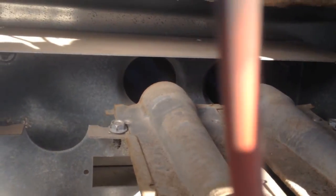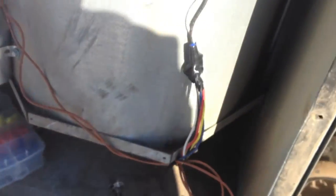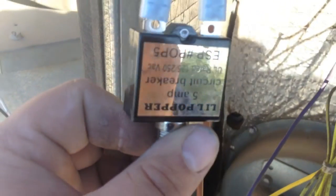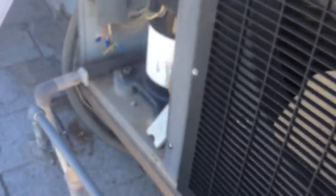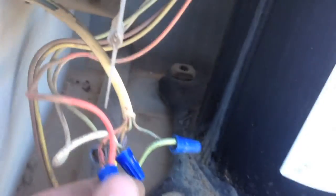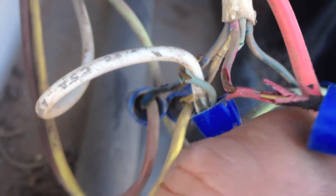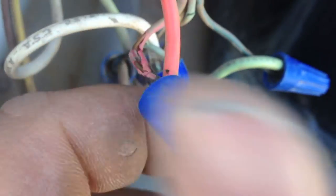It's all running — everything's running off the thermostat. Gas pressure looks good. I'm going to let it run a little bit. Got it looking much better, much safer. There was also a blown fuse when I got here, so I used my little popper to trace any issues — and I did find one over at the junction box. You can see the insulation is peeled off of this red wire here. That's just the Arizona heat right there.